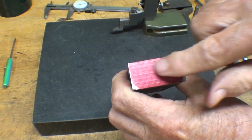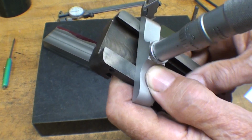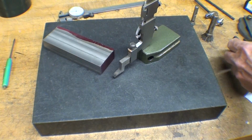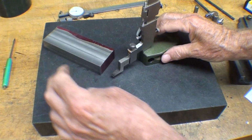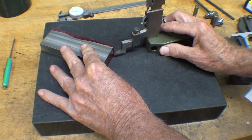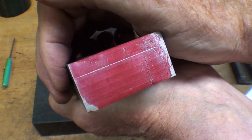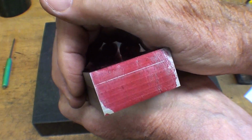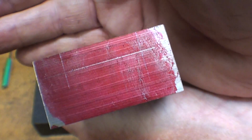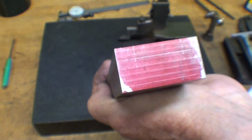Now let me lay it off on the end here as well. The dovetail is 260 thousandths deep. Now there's some clearance in there too that I'll talk about later, but the height gauge is set for 260. And actually I'll dial that depth in with the Bridgeport. And that's just the slot that's laid off right there, not the dovetail itself. I'm not going to lay that off. That's to be determined, of course, by the cutter.